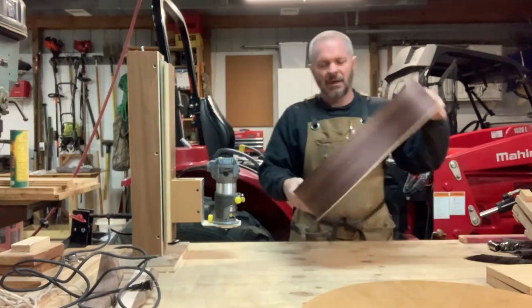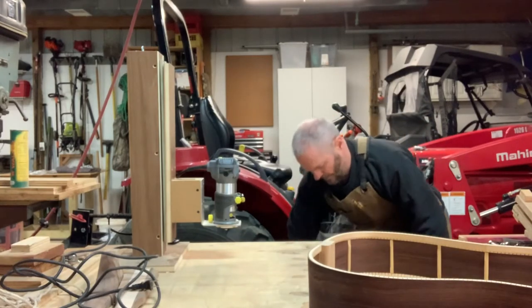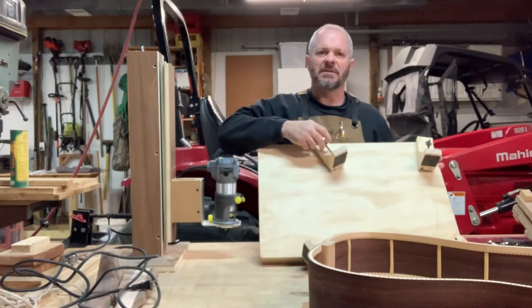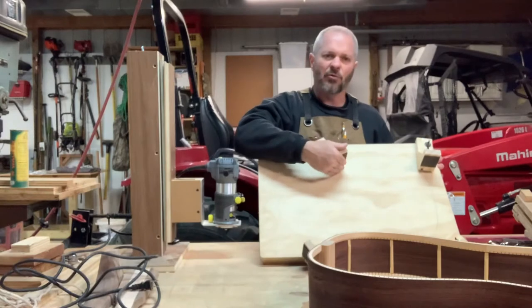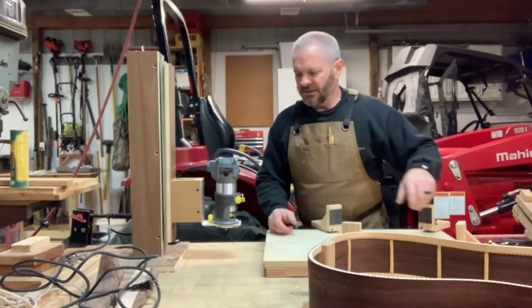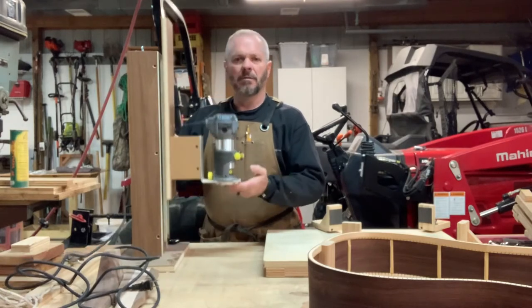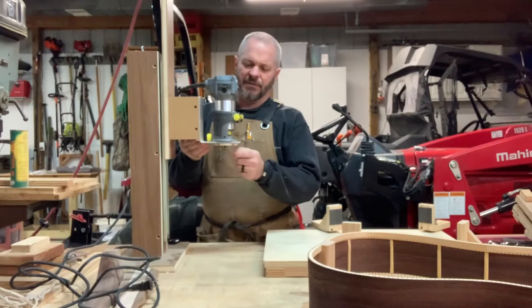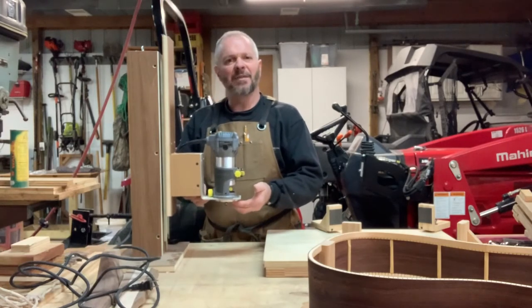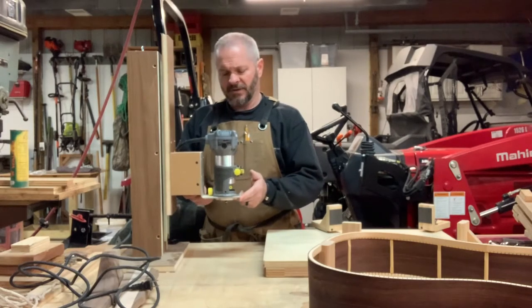I've also cleaned out a little bit of the excess glue. I have a jig here that allows me to put the body on it — it's slotted with wing nuts that I can thumb-tighten, and it's got a little rubber stop that holds the body of the guitar. The jig holds my trimmer on a regular drawer slide with a little piece of Teflon on the bottom, which rides smoothly on the face of the guitar and keeps the trimmer perpendicular to the sides so it trims properly.